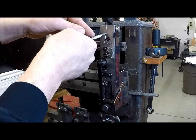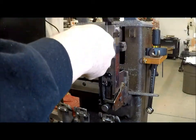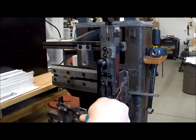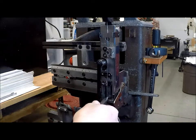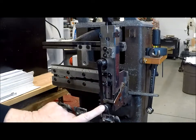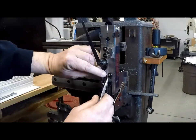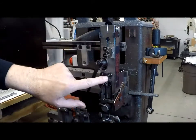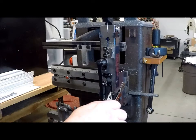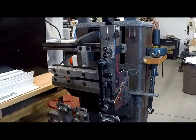Now let me demonstrate. I'll pass this up, pass up the grip, and put it right into the cutter hole. Then I keep pushing it until it's sticking out of the bottom of the head. Pull out about a foot of wire. Make sure your swivel is connected. Open up this and push the wire back behind there — now we're in there. Open the grip, make sure the wire's in the grip. Now I'm going to reach down here, hold onto the piece of wire, recycle the head, and cut the piece of wire off. Now the head's threaded.